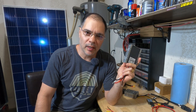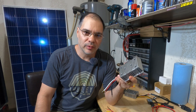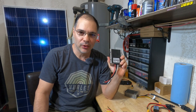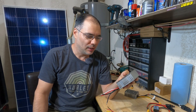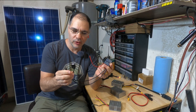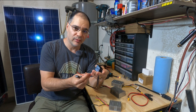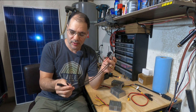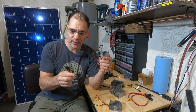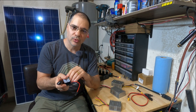It's probably not worth shipping back because shipping will cost as much as the unit, so it's definitely worth $45. This unit will do everything: it'll power USB devices, power 12 volt solar appliances, and charge batteries quite well. We're also going to take a look at this USB converter, which takes an input voltage of 8 volts to 85 volts — pretty awesome. You can use smaller 12 volt solar panels with this and power USB devices directly. It puts out 3 amps, which will power any USB device.